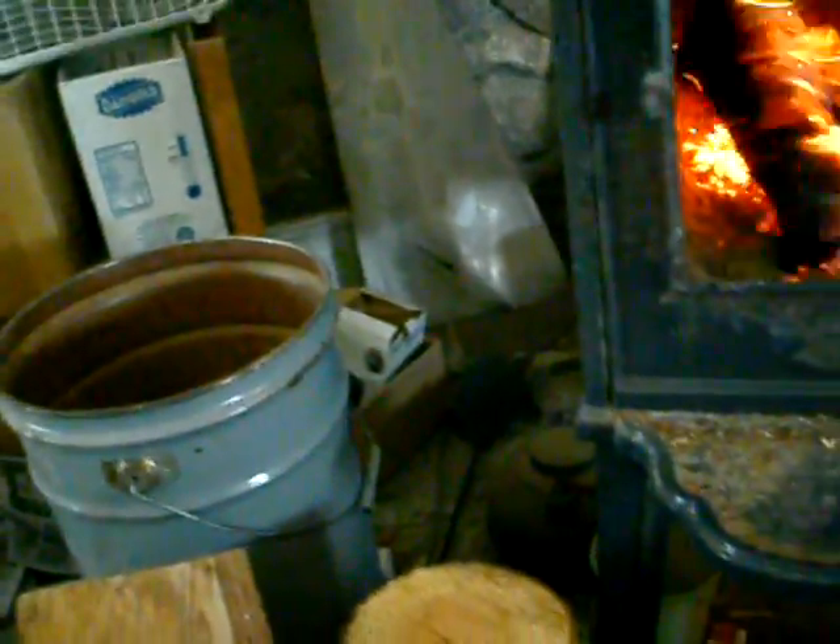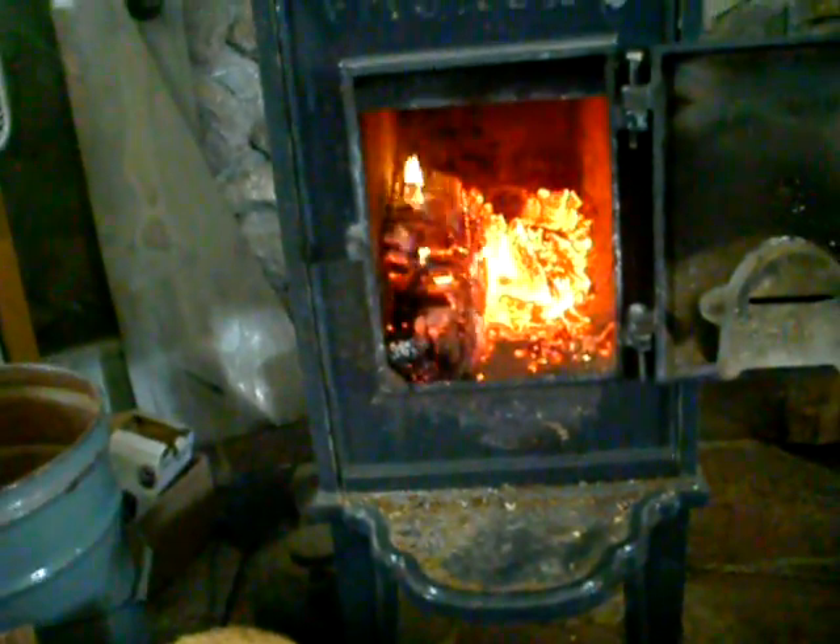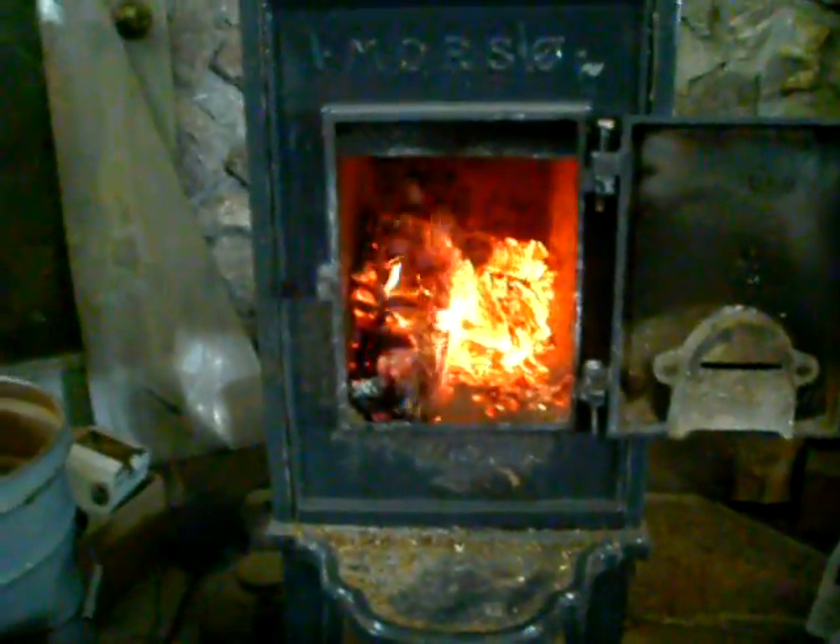But if you look, this 5/16-inch thick steel has warps — it warps badly. It's got a hole here that's broken out, and a crack down here. Over on this side it's the same story — a big old bulge and warpage. This is not thin steel, and it's warping just from burning wood. Not coal, not oil — just wood. So what is wrong with a rocket stove made entirely out of sheet metal? What's wrong with using steel at all in a rocket stove?